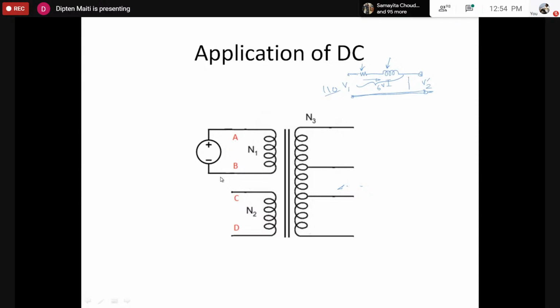Here we would have some induced EMF that would oppose the primary voltage V1, and this voltage must be 104 volt. Here, of course, I am neglecting the phasor notation, because 6 volt and 104 volt must be added algebraically, not arithmetically. Pardon me, because I have just added them up arithmetically. This must not be done.